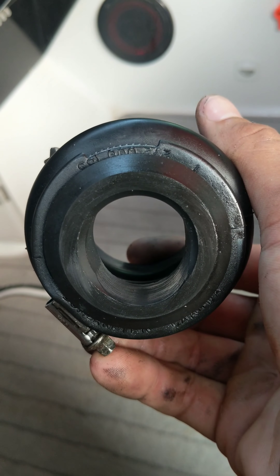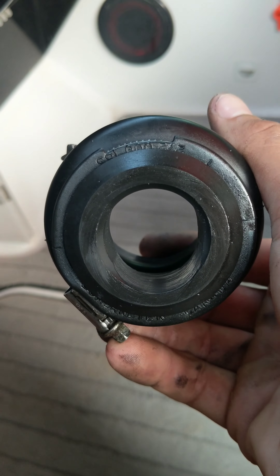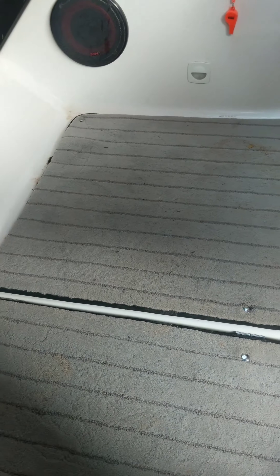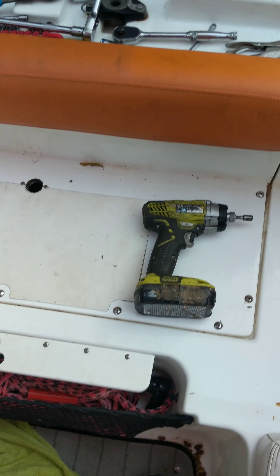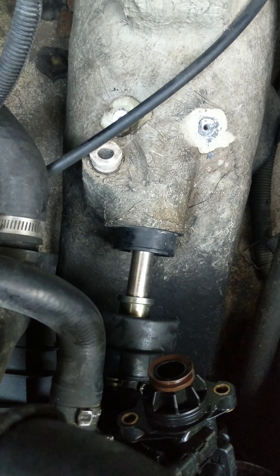Those are a few of the ins and outs on the alignment for these boats. The other thing I want to cover is how to remove the driveshaft guard: there are two Phillips head bolts with nuts on the other end. You have to remove the silicone placed over them to expose the nuts, then you'll need someone to hold the nuts on one side while you unscrew on the other. I'd recommend replacing the guard with hex head stainless steel bolts if it starts to strip at all.